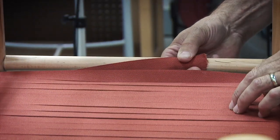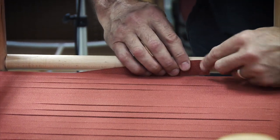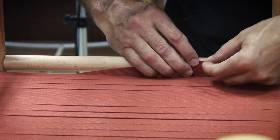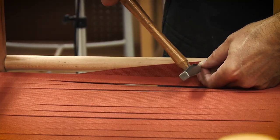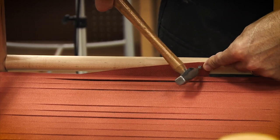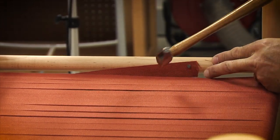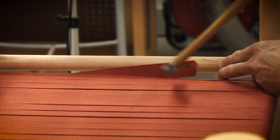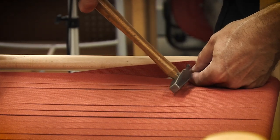So I've gotten my tape wrapped around — the warp is done with the red. I'm going to cut it short here at the front rail and tack it just like I did on the other end, to the inside face. Again using the number four upholstery tack, carpet tack. And we'll do a second one for good measure.